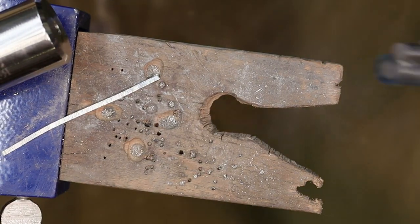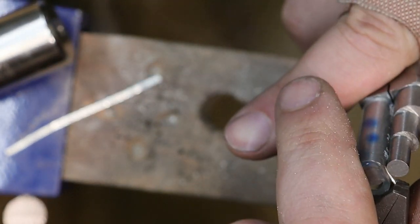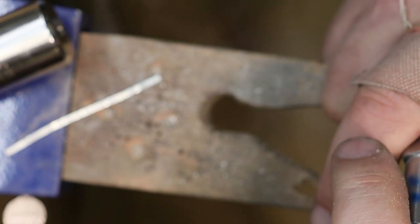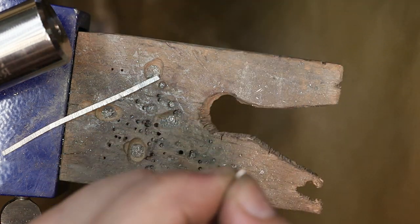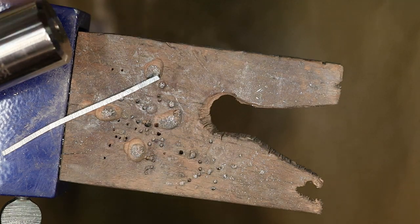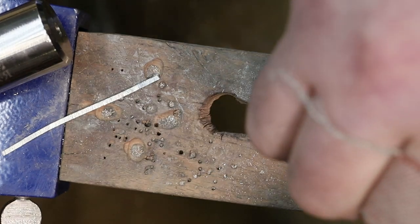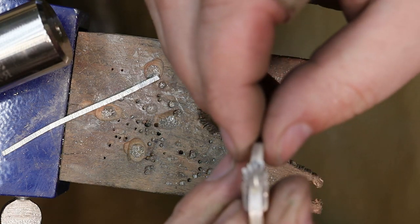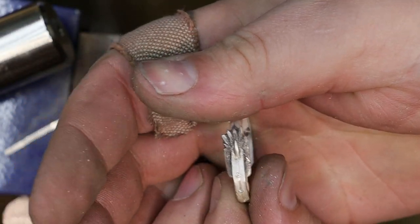All right, so I have that tongue and half rounds, or kind of these round jump ring pliers. I have it in there, and then I'm gonna give it a little push around that mandrel with my parallels, and that's gonna give it a little bit of a curve. Hopefully that curve will help eliminate some of the forming later on. Looks like it did. So now that fits nice and flat. We'll solder that in place. So we'll save him over there.